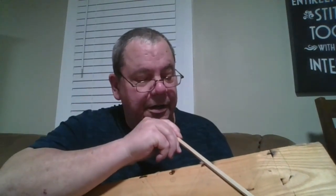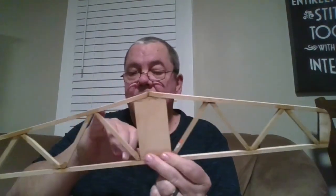All the others I changed to a different color and actually turned the output off on all other colors except blue. So I can go in, set those two marks, and then just lay a piece of wood across it and set the laser to run, and it cut out the pieces that I wanted wherever I had it set.